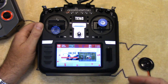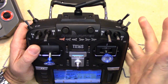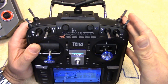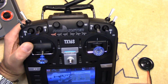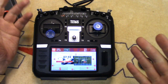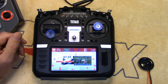Now the second little mod we're going to be doing while we've got it open — people have asked me how hard is it to switch your toggles around in the back. I've got my throttle hold on the right side and my sprung on the left. I've been flying for years with my throttle hold to position on the right side of the radio. I'm not about to relearn it, so if you're in the same boat and that muscle memory over years or decades of flying has left you wanting a two-position on the right, I'm going to show you what's involved. It's not hard, but there's a lot — you've got to take the gimbals out, pull the circuit boards out, desolder the switches. As long as you're comfortable with all that it's not hard at all, but if you're not, probably best just leaving it alone.